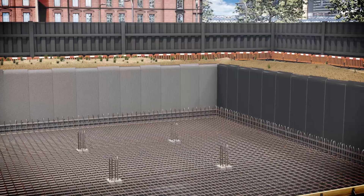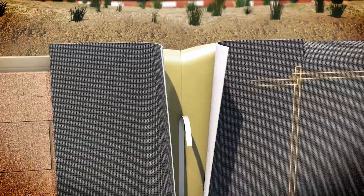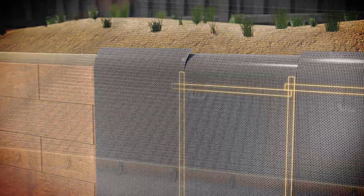The seams for vertical applications of bentonite membranes are vulnerable to failure. CicaBentoShield laps are sealed with tape, which is tested and BBA-approved to BS EN1928, to provide a watertight solution, as well as protect against debris and water intrusion during backfilling the system.